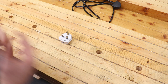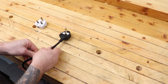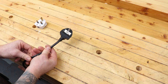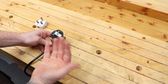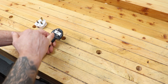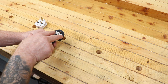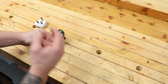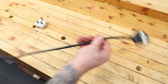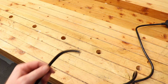The other type you're more than likely going to see is most appliances nowadays come with a sealed plug top, which you cannot open up — all you can do is change the fuse if it blows. These can sometimes heat up and separate from the fuse, causing arcing that can melt the plug top. So today we'll put this plug top on the end of this flex.